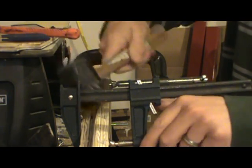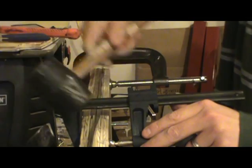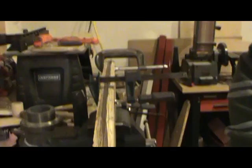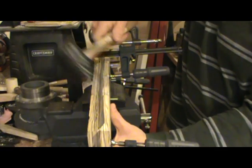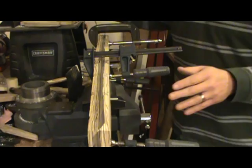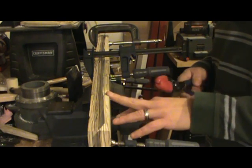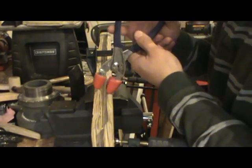You can move the clamps out of your way as you get down to them, then move them back. Because the rib sticks so far out from my bench vise I hold a little counter pressure as I'm moving toward the end. Once I've gotten roughly the same angle on the flange all the way down, I'll stop. I'm going to put the flutes or crimps in the material now, because if I don't do it at this point it's going to be really hard to get the pliers in underneath once it's laying against the material.